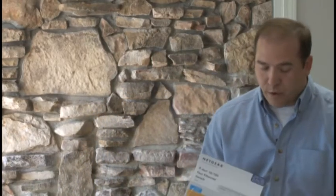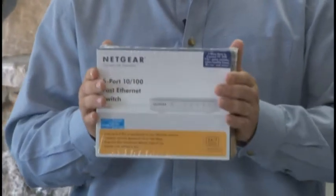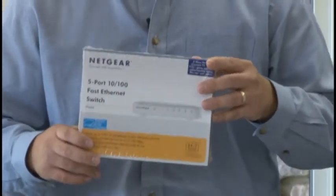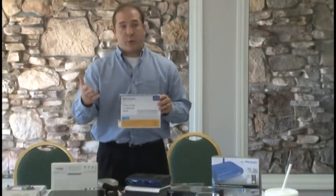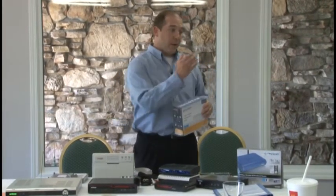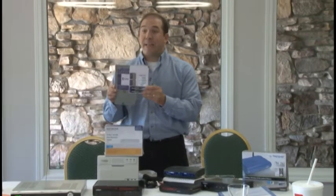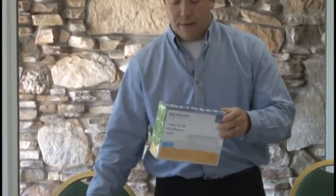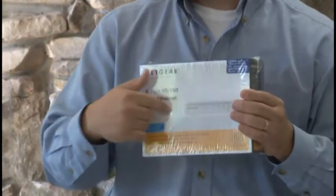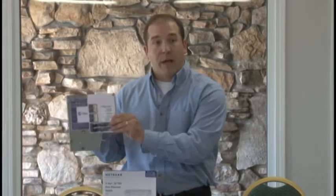I want to run by a couple of other products we're going to have in the customer's houses. This is a switch — one of the switches we'll put in the customer's house. The main purpose of this switch will be if customers have more than three or four set-top boxes in their house, or depending on how their houses are wired. Another tool in the tool bag. A lot of our older houses have cables home-run from the back of the television to the outside of the house, and they'll plug right into this device. If it's a newer type house with a media hub under the staircase, they'd go back to one location and we'd use this device to deliver the signal to all the set-top boxes and computers, then run one cable to the outside to plug into the ONT.